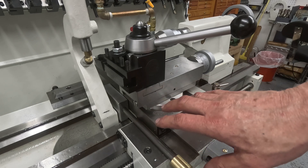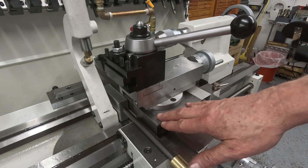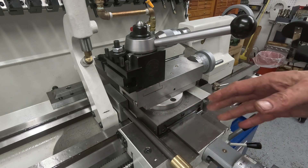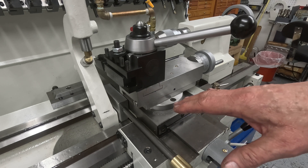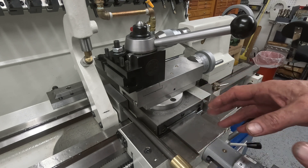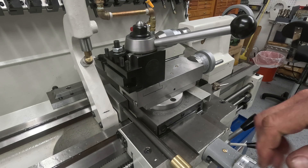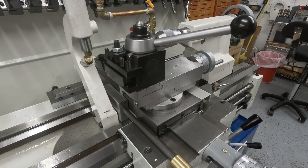I'm very happy with it. It does the job — holds the cross slide, stops any slack from the backlash coming into play, keeps my hands back out of the way of any parts being machined or the chuck or whatever, and still allows use of the follow rest without removing the cross slide lock. I call that a win.